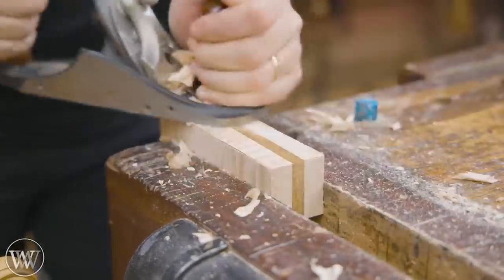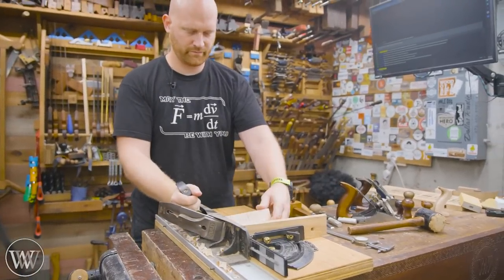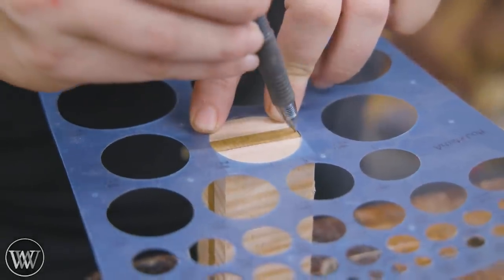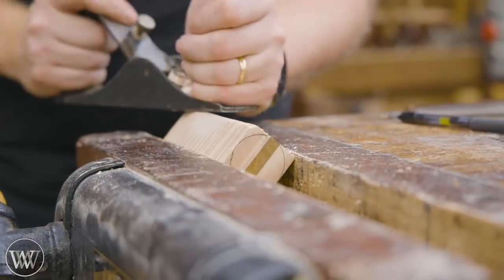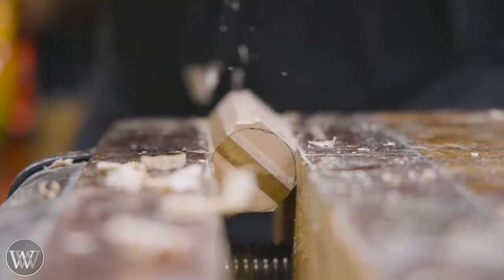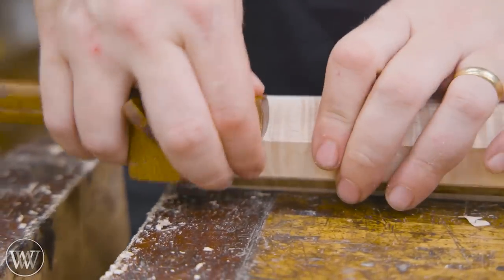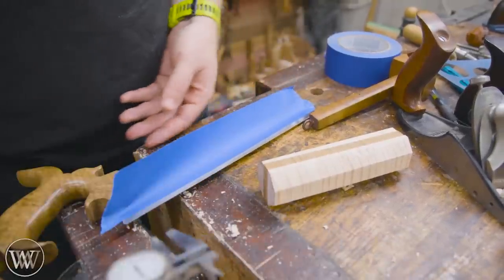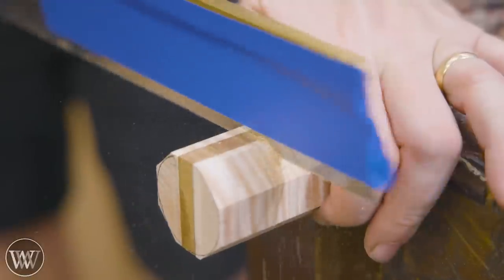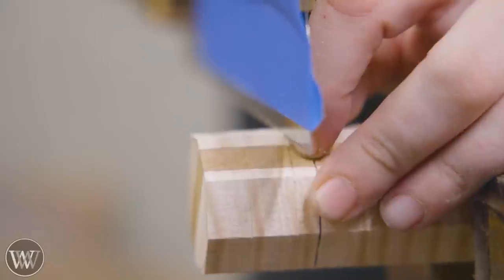I'm going to leave this long — originally I planned on cutting it short, but leaving the mass on there gives me something to hold on to while working. I'll use the original tote to find all the clearances, then plane down the corners until it gets to the octagonal shape. I can use the scrub plane to take off the majority, staying away from gouging too deep in this curly maple, then come in with a plane and turn the octagonal shape until it just touches the reference circle. I'll mark all the way around at the smallest point, the largest point, and the bottom of the knob where I'll cut it off. I put tape on the saw and saw until it just touches the tape, rotate a quarter turn, and do four sides, then connect the dots for the other four.